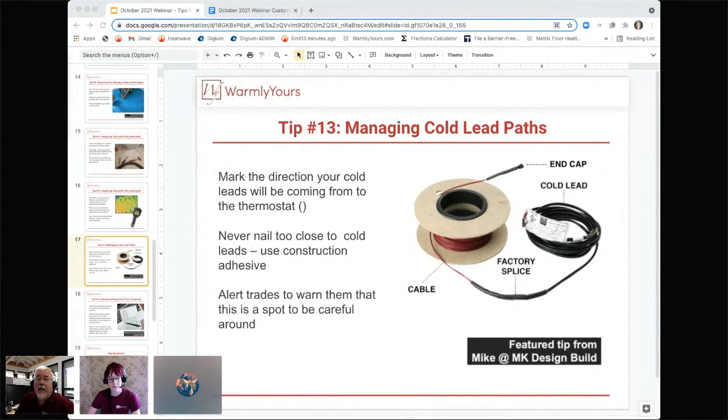Well, we don't really have a lot of problems with tile, but what you want to look for is to find out if the manufacturer says you have a temperature limit, high and low, which means you can heat the temperature up to 81 or 82, and you can deviate from that 2 or 3 degrees per day, and that's it. Because our thermostats have a setback feature, when no one's using them, you can heat it up to 85, and then when no one's using it, take it down to 68, and you can do that with tile. That's no problem. That's a setback.